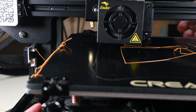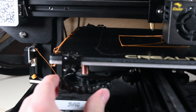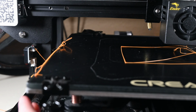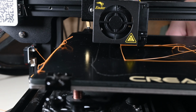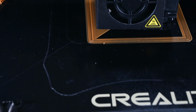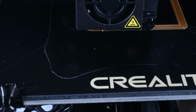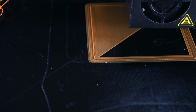Well, that's less than ideal for sure, but at least it's not etching the bed while grinding down the precision tip of the nozzle. After only a little bit of frantic on-the-fly bed level adjusting, I started to have something that looked somewhat reasonable. I'd fine-tune this better later, but for a starting point to start printing calibration cubes and setting steps per millimeter numbers, this is good enough.